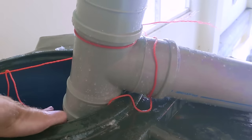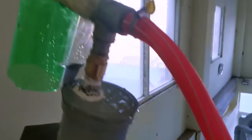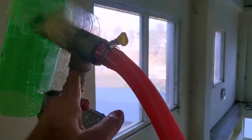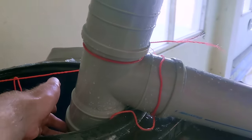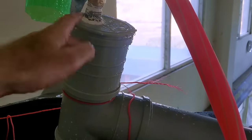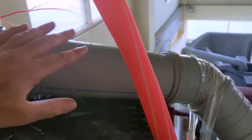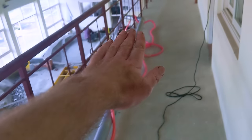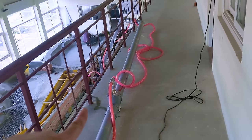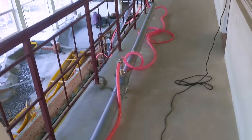The water will be up just below the top of the tank, gets sucked up a bit, then I turn the water on, it comes up and out, turn the water off, sucks more volume of air out — about seven or eight liters with this length of hose. It comes up a bit, and usually on a third cycle it starts sucking water. This whole water column is elevated over the tip-over point, starts tipping over, runs straight down this drop, blasts all the water out, and then that starts the siphon, which blows any remaining air out of the whole system — and then you've got a full siphon.